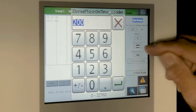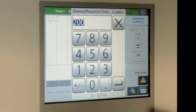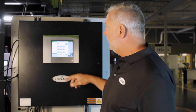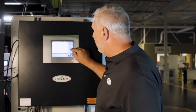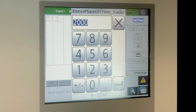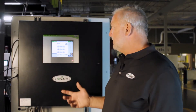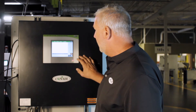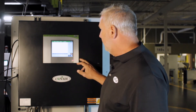Now we have the air pull time, measured in milliseconds. This tells you how much air between pulses you're going to put in, in time. Then the last box is the material pull time — in milliseconds, 2000 is equal to two seconds. Those are the four settings to operate the wave. It's very simple.